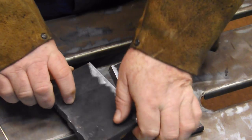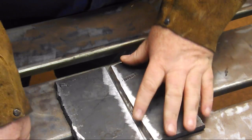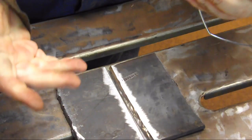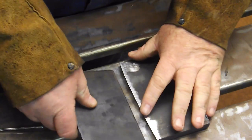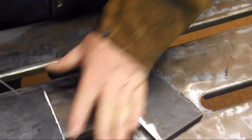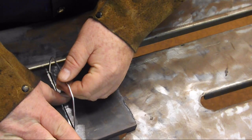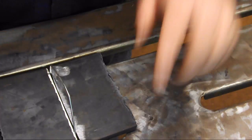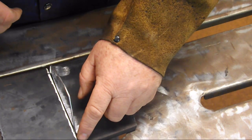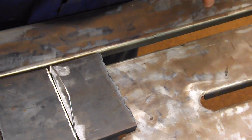Here we've got two pieces of 3/8 inch 1018 mild steel. They've been beveled and they have a 3/32nd land on them. I'm using an aluminum welding rod as a spacer — it's soft and easy to bend — and we're going to flip it over and stick it in there to set our 3/32nd gap. I didn't cut this piece perfectly so there's a little extra gap in one spot, but when you're welding for a living you deal with that kind of thing all the time.